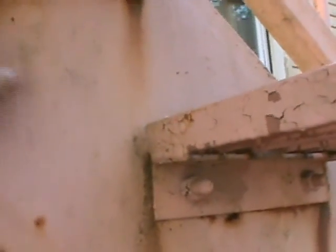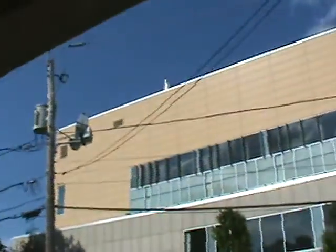So we need to verify this railing system that is part of the whole structure. Again, you've got connections here that if you open them, clean them, silicone and close again, it will be in good condition. Again, some rusted ears showing somewhat of penetration, but they're tight to the building, so you need to clean up, prime, and silicone from the top and the sides, and we'll stop that problem. But some of them need to be opened, because you can see some of the rust already building. So we need to open and clean them, prime them, seal them.